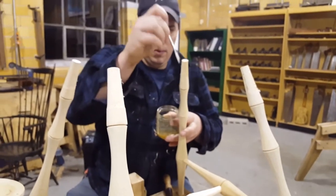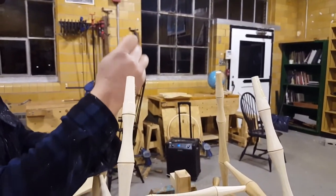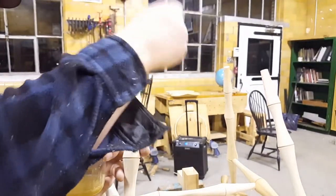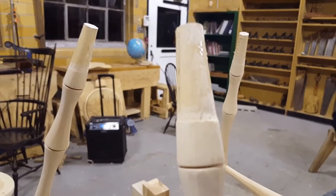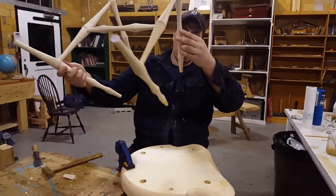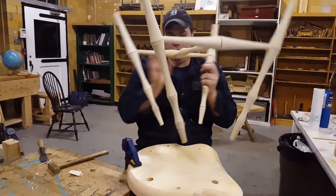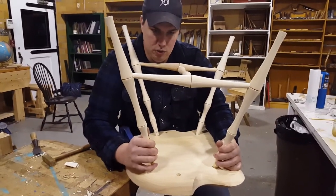So when I put this all together, they lock in the upward position. And then I'm going to double lock them by driving a wedge through the top, just like an axe head — basically the same joinery that's used to make an axe. You stick the handle into the head, then you drive a wedge from the top. As long as you don't leave your axe out in the rain it stays good. But these chairs — I have actually left these out in the rain and they're all pretty good. These are all kiln dried too; I've cooked them in the kiln for several days, just the tenons, and they are as small as they're going to be without being on fire.